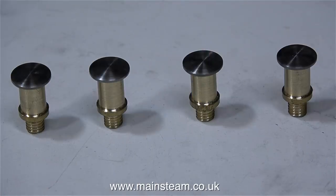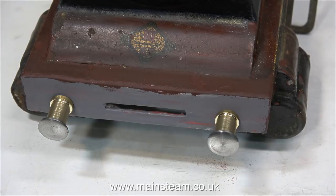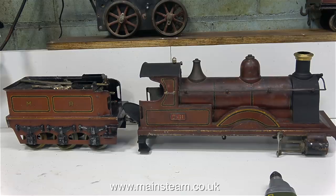And here they are. I never wanted them to be polished — polished buffers, to me, don't look good. They need to have some machining marks, but scale machining marks, which is obtained by using emery cloth and wet-to-dry sandpaper. The machining marks left on the buffer heads from the machining operation were far too deep. Here are the buffers temporarily fitted to the front of the engine. After I've mounted the buffer stocks permanently to the buffer beam, I'm going to paint the buffer beam and the buffer stocks, followed by fitting the buffer heads with a suitable spring inside. And that's about it for this episode — I'll leave you with this side view of the engine body and the tender. Thanks for watching, and I hope you found it useful.